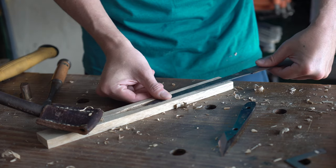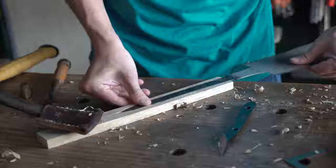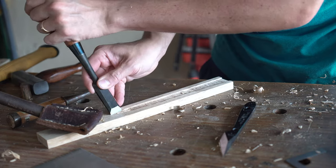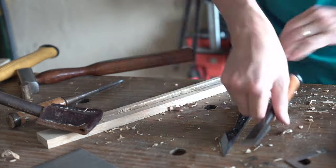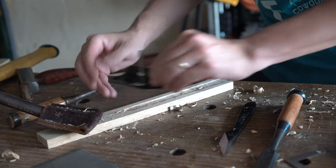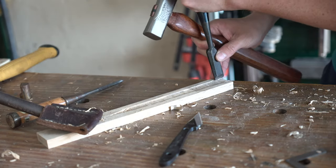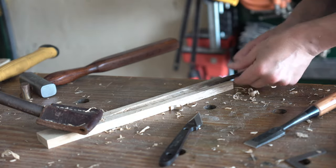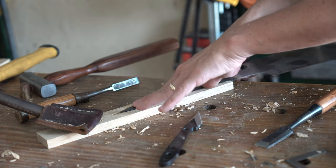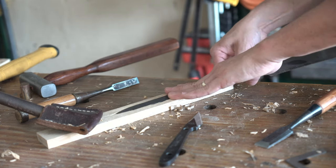Since the tang ends up seated without any adhesives or fasteners — a pure friction fit — you really should do a few test fits and slowly provide relief in the areas that are tight. I found most of my trouble spots were at the far end of the tang at the little pointy spot, and also at the forge weld where the tang meets the neck and shoulder. Be careful when chiseling toward that neck area because too hard of a hammer strike in just the right location will end up splitting your handle entirely.